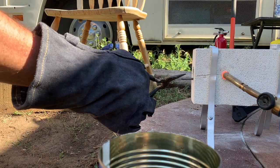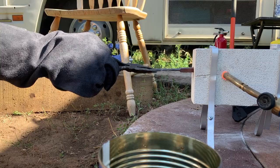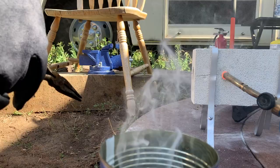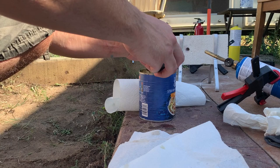It's time to forge. That process is in a longer video linked here. I just tapped the blade on a magnet attached to the vise. When this steel reaches critical temperature — about 1,400 to 1,500 degrees — it becomes non-magnetic, at which point you quench it in the oil and it will have changed on a molecular level. After quenching, the blades are now crystallized in a very brittle form; they can be smashed like glass almost, and if you drop them they could break.